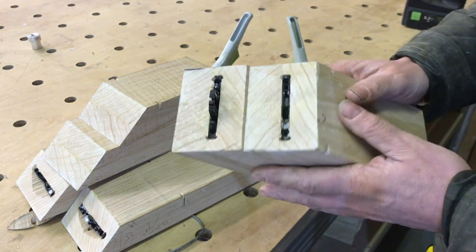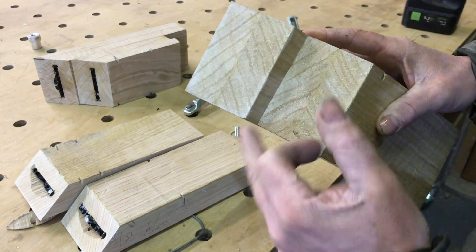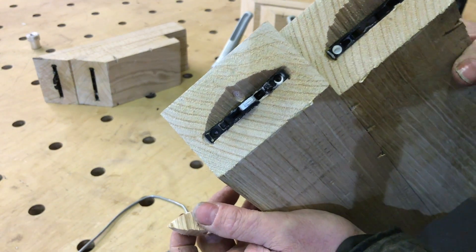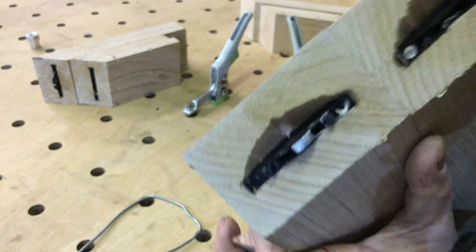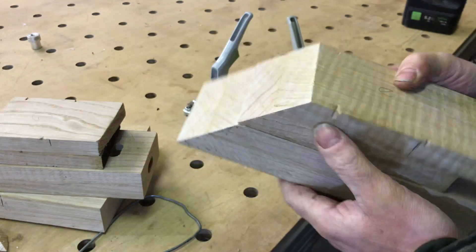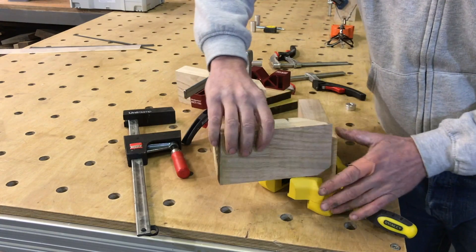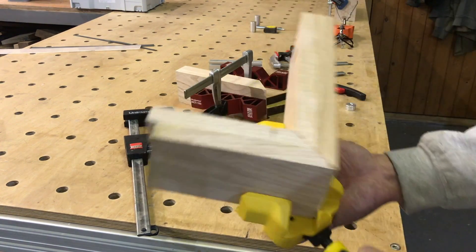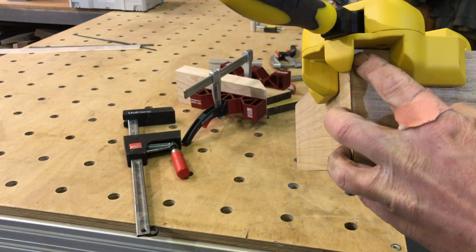Taking a quick look at the results: on the Tenso we've got a glue failure, and the connection itself looks okay. On the Tight Bond 1, again just glue failure - the face of the wood is fine. Quite different on the Clamex - it totally broke out this section here. The readings on the scales - if you were here trying it, the Clamex feels really, really strong, followed by the Tenso, and the Tight Bond 1 alone just broke really quickly.